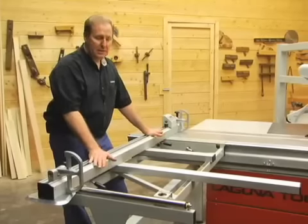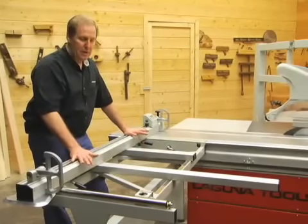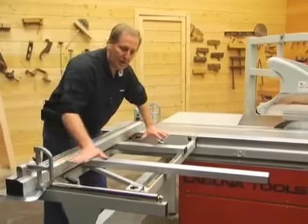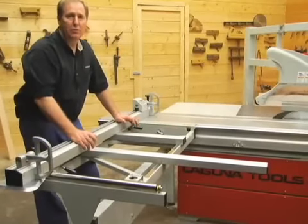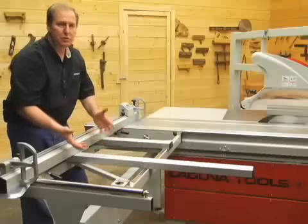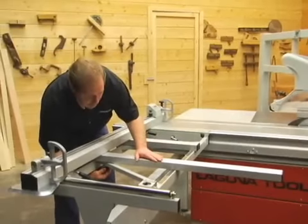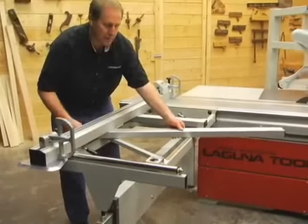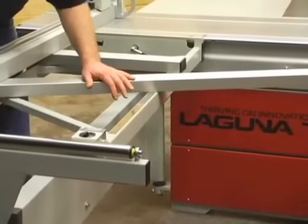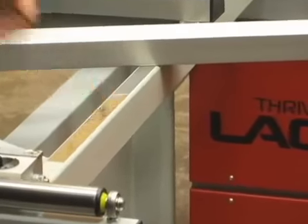We've moved down to the far end of the sliding table — this is what we call the crosscut table, and it's supported by the long swing arm on the bottom. This is a standard crosscut table, though there is an optional mitering crosscut table where the entire table moves on parallelograms, allowing it to be pivoted and mitered, available with a digital readout. On the standard table you see this nice long aluminum support rail used to support wide panels. It can be adjusted by loosening the knob on the bottom and moved at different locations up and down the table assembly. You can see these ride on a nice metal strip rather than on the paint, which prevents chipping. The fit and finish of this machine is absolutely flawless right down to little details like this.